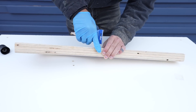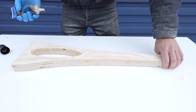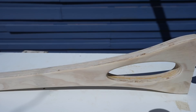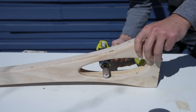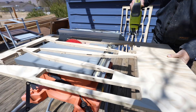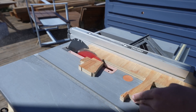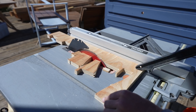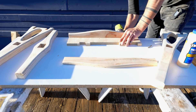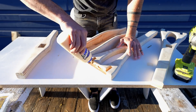This sanded pine plywood is pretty rough, so I used some wood putty to fill in the major gaps. I then used my orbital sander to sand all the pieces to 150 grit. A drum sander on my cordless drill came in handy for those elliptical holes. There was some scrap left over from the CNC, and I'm using those pieces to make supports that aren't visible — I cut them to the right width on my table saw. These scrap pieces are hidden between the upper cross supports, and I'm going to screw through them and into the tabletop to secure it.